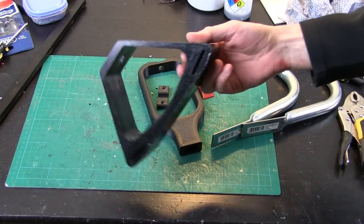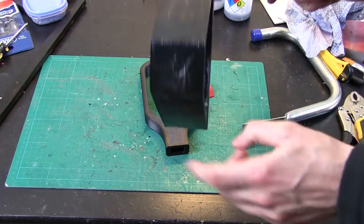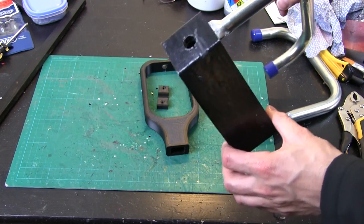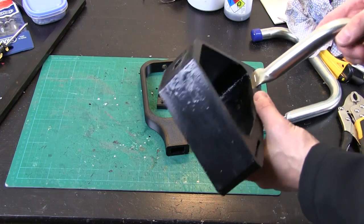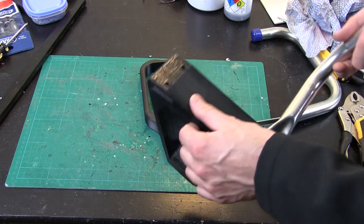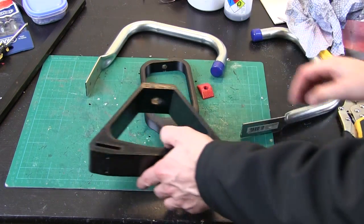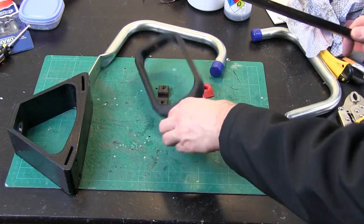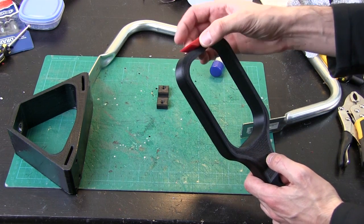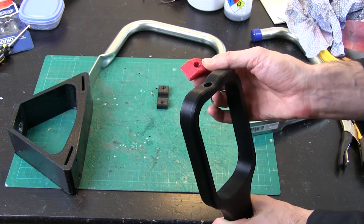Here are my parts — the main piece which these parts slot into to make a nice chest hook shape. I've wiped this over with acetone and filled in some of the splits that occurred — it's ABS, so being quite a large part there's been some warping which I've sealed up, which is why it's quite shiny. I've brushed acetone all over it to seal up all the build lines so it's going to be strong and doesn't break while I'm wearing it. We've got our stick and our gimbal piece which mounts on top, supporting the alien's head along with this piece of NinjaFlex which will be glued onto the wooden frame, and a hole drilled through all three so I can bungee it on.